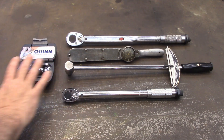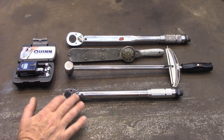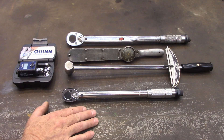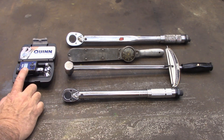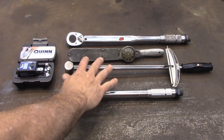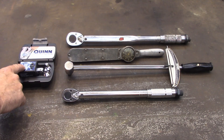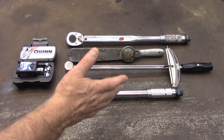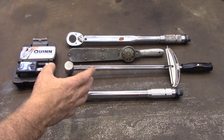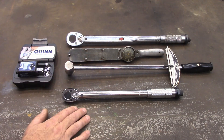These are the only torque wrenches I have. I don't have any kind of laboratory-checked reference. So I don't know exactly how accurate it is, but my thought process is I'm going to use this digital one — when you put pressure on this, it goes up in increments so you can read how much torque you're putting on it. And so if they all correlate except one or two, then I think that'll tell me they're all accurate except for that one or two.